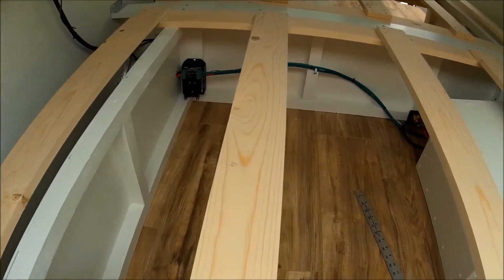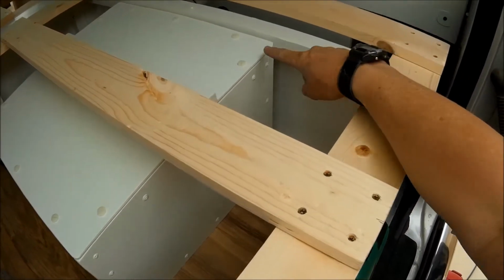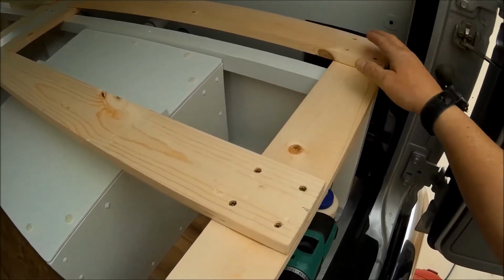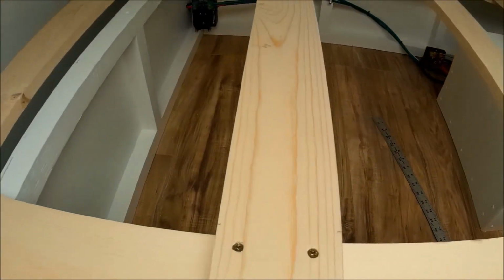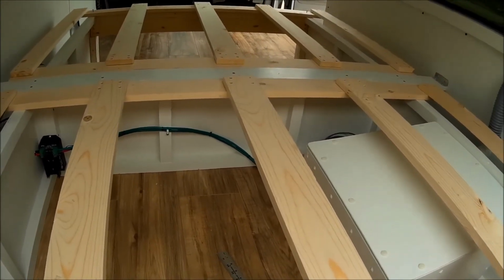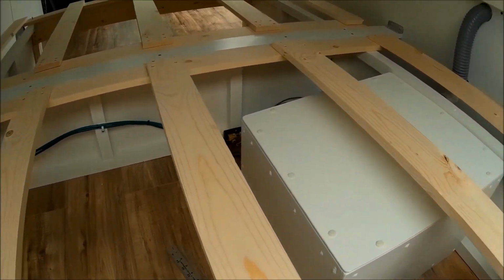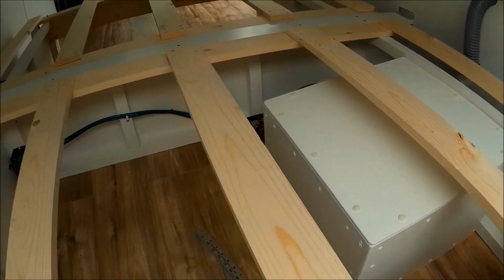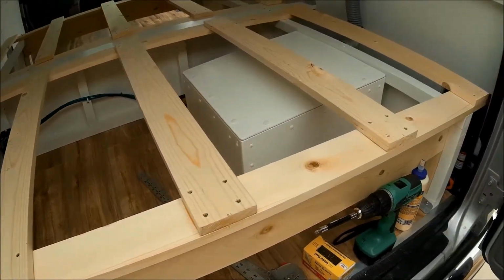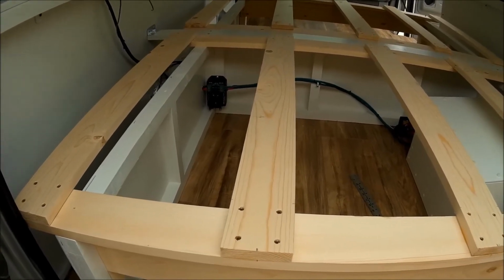And then the way that foam mattress is, what I'm going to do is run a piece of this 1/4 inch underlayment stuff that I'm using on everything else, just to cover across two sheets, one across this piece and one across that piece. And that'll give it support so the mattress won't press through. Plus that'll be glued and screwed on and give it some additional strength. But I think it's coming out pretty light in comparison to 3/4 inch plywood.